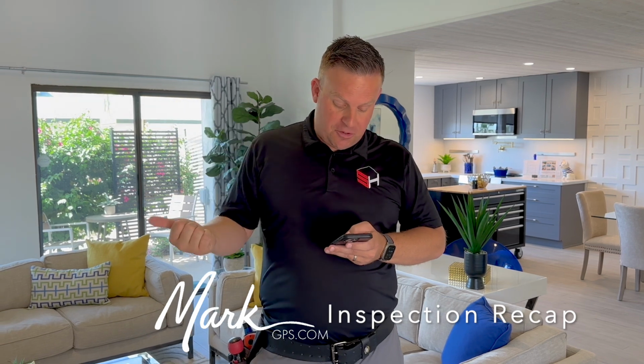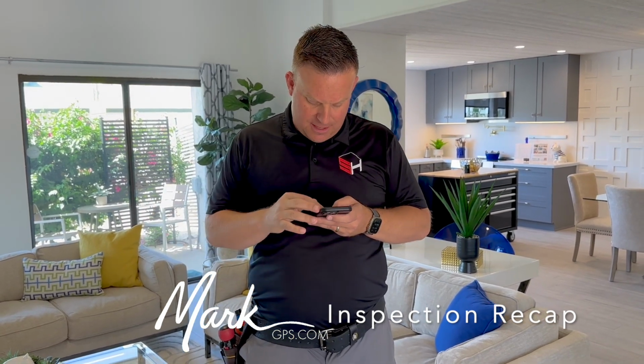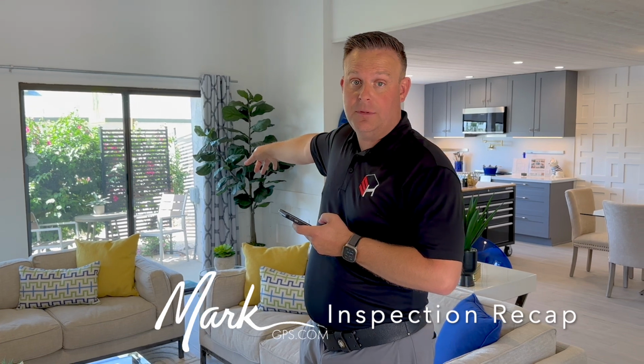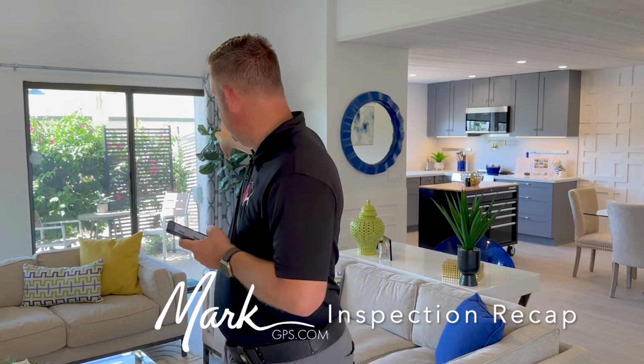You'll see water pressure is great. We want to be between 60 and 80 pounds. We're right at about, I think it's about 78 pounds. And where's that shutoff? It's in the back, right behind the electrical panel. Okay, so everything's kind of right out there. Yep, and it's around the corner, past the bogey over there on the right-hand side.